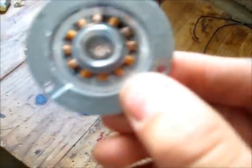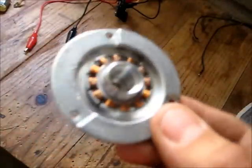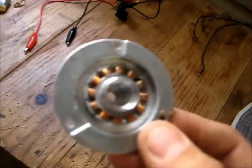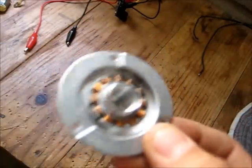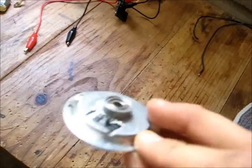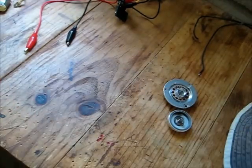Okay viewers, you see there where it's blackened? Well, that's where the windings popped. Spat a big black carbon mark there. Looks like one of those Fisher & Paykel smart drive motors. Basically is what it is. Big Fisher & Paykel motor, it's just a large one of these, only driven to run at different rotations and all that sort of stuff. Yeah, it's pretty much a BLDC motor.